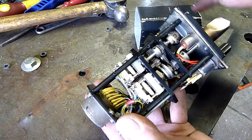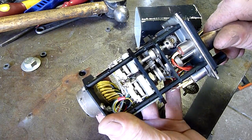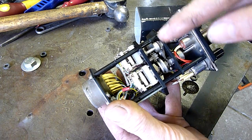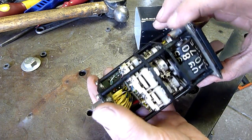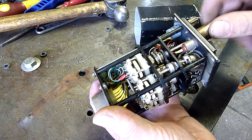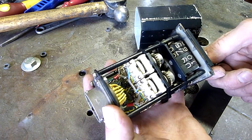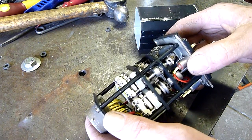You can see these two here are turning over together - that's because I'm going from 29 to 30. But if I go 30 to 31, only the bottom one turns, because these little gears and little cams have to do a certain amount of revolution before they line up again and trigger the next switch - which would be the tens. The half digits work similarly. I'm only speculating how it works; I haven't looked it up yet. Being a Sabre Jet component, information probably isn't that common.